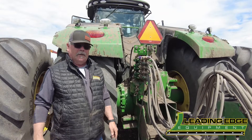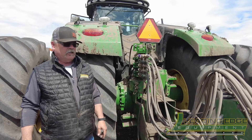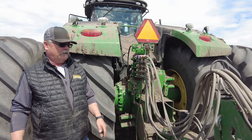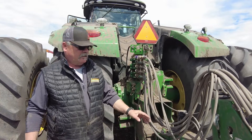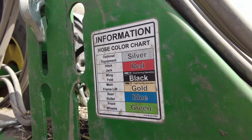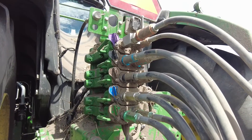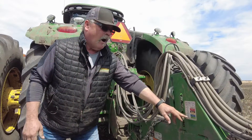Hi, I'm Mike Hammond of Leading Edge Equipment. Today we're standing out in the field with a John Deere 2680H. We've had a lot of talk on how to set them up and where to run them. Right here, if you look on the hitch of this 2680H, they've got a color coding. And if you look up on your tractor, they've got the same colors. Just hook them into color coordination of what this says. I always run the green as number one.